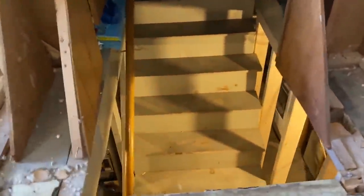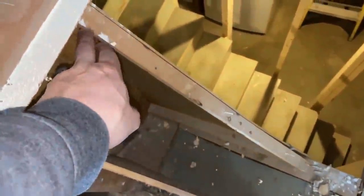So right on this side, the closet, or what's gonna be the closet for the bedroom, I can frame this kind of like this is. I'll go straight down from here and frame it like this so that opening stays even, with that 2x8 going across here, and I'll go all the way to here. And then on the other side right here, I'll take that small lip that's hanging over that 2x8 and match it down here. So it'll go probably about here, all the way to here.